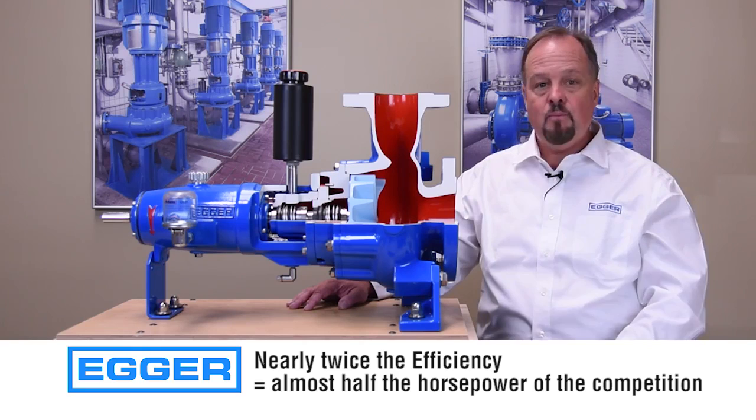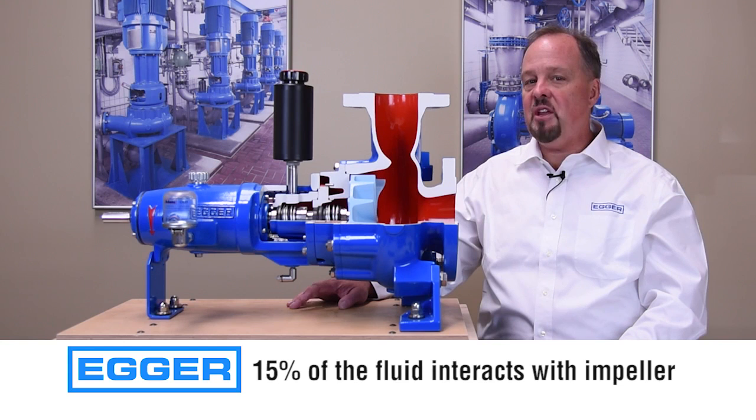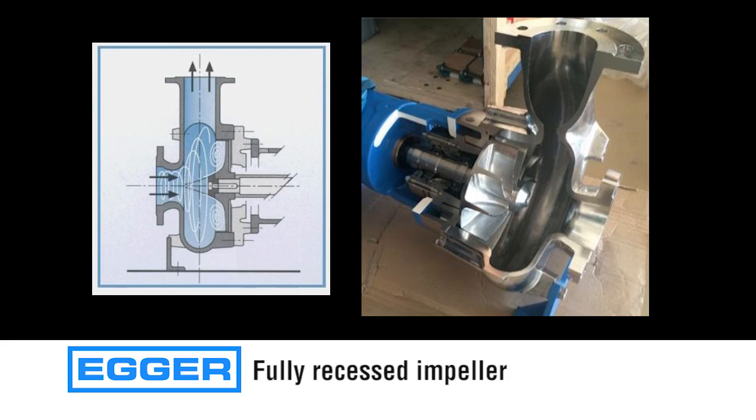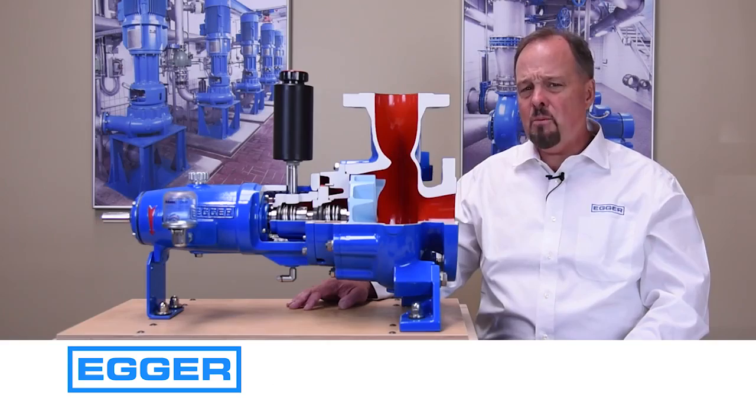Less wear because only 15% of the fluid interacts with the impeller. More efficient since the impeller is fully recessed into a housing with tight tolerances necessary to create a full vortex without clogging and wear. Some of our many features include